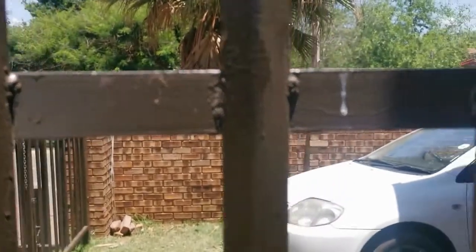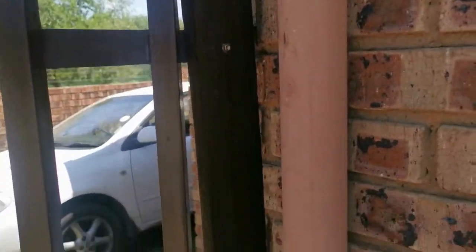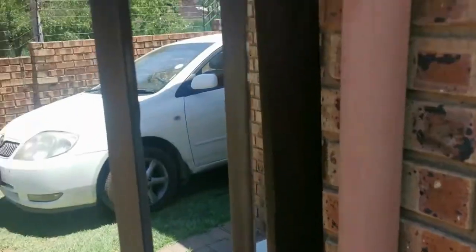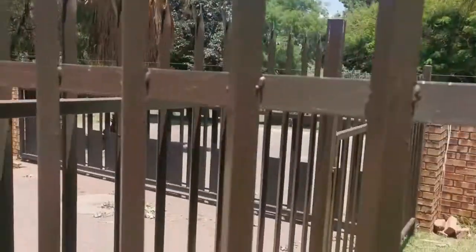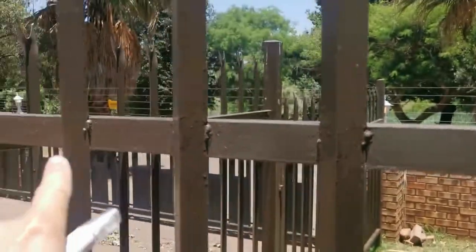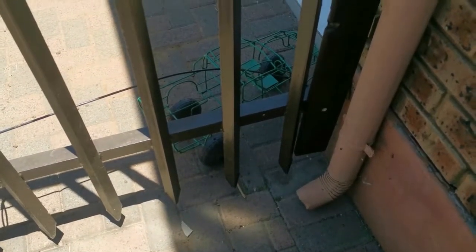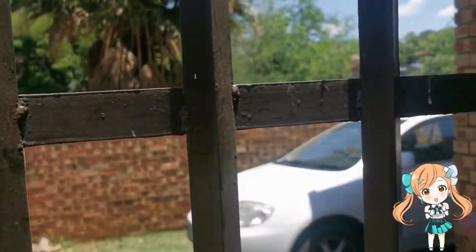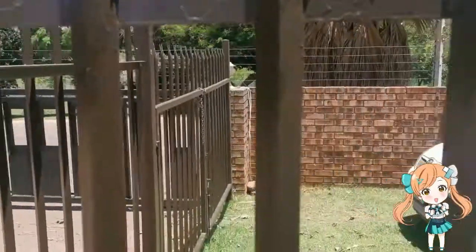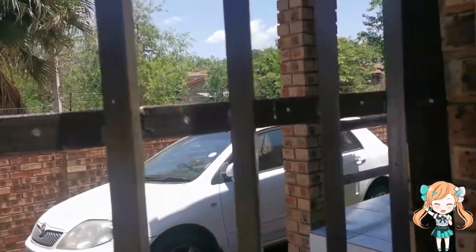Next up is to drill the holes in the middle. This angle iron that the palisade is made from is extremely hard — I thought the tech screws would drill themselves in, but there's no way. So I had to get the drill bit, make holes everywhere, and line them up with the holes in the planks, making sure they're all the same height and level. You measure the distance between the poles, get the center, punch them, and drill top and bottom. I took a center punch, punched the guide holes onto the middle, and drilled all my holes until they were all done.